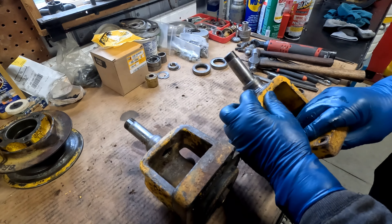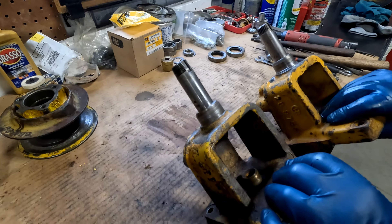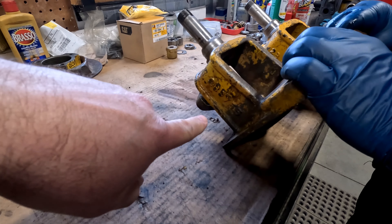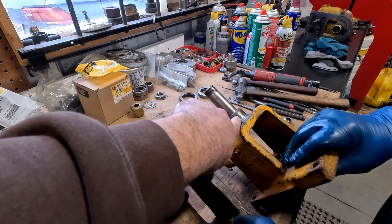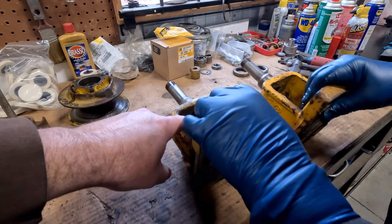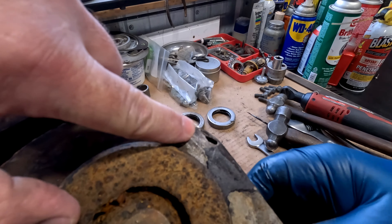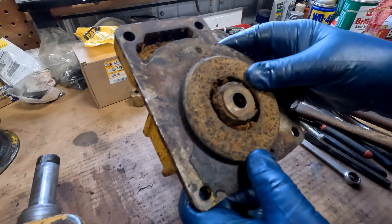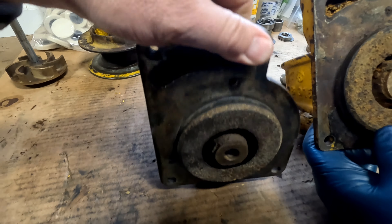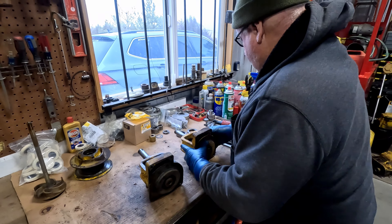A hundred thousandths — a tenth of an inch it wore back. See how this one isn't worn? We're comparing the water pump housings from 7J and 4G — they're both the same part number, but there's a lot more wear on the 4G one. That seal had walked out, and on the back it's actually eaten through — there's a little hole right there. There's also a lot of scale, barnacles, and calcium deposits that the 7J one doesn't have. So this is definitely our better option. 7J pays off again — we would have been hosed without that parts tractor.